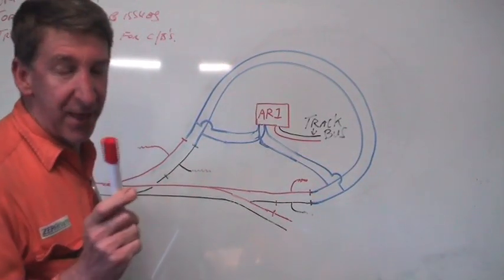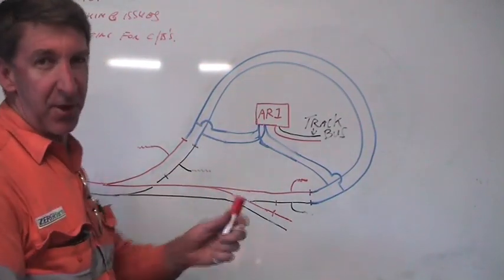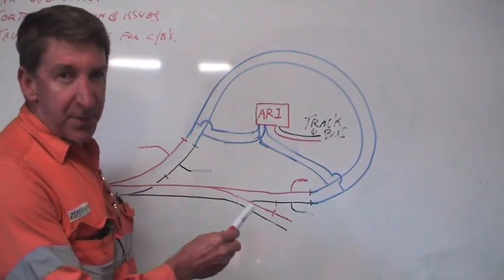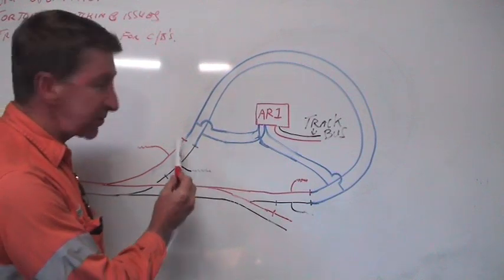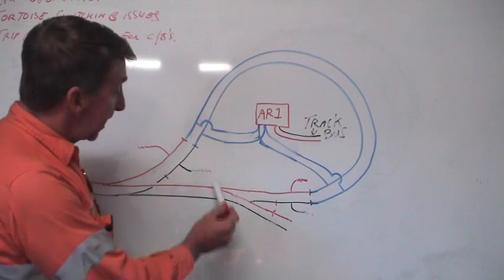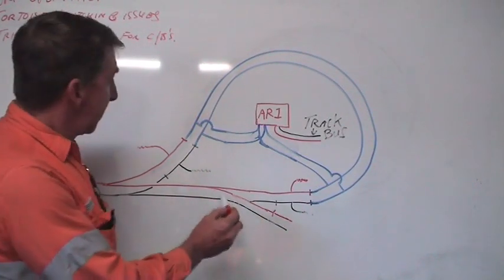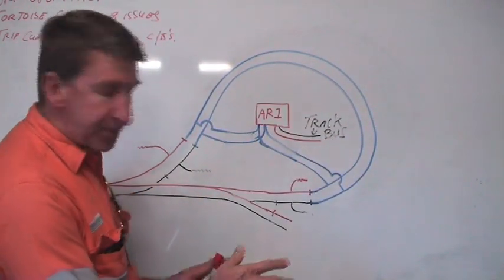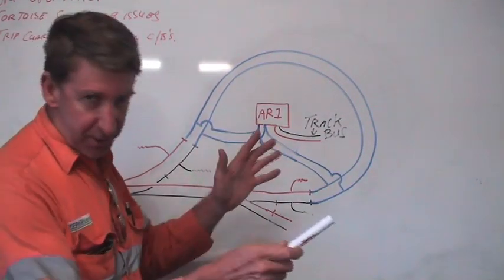Well, some of you may think that it changes the polarity of the rails. But I'll take my model railroader's hat off and I'll put my electrician's hat on and say, it doesn't really change the electrical polarity of the rails, because remember our DCC system runs on AC, so there is no polarity. It runs from positive to negative at about 50 times a second. So these two rails are always going positive, negative. So changing the polarity is really not necessary. There is no polarity. All your decoders run off AC. They convert that to DC to run the motor and the lights and all that sort of thing.